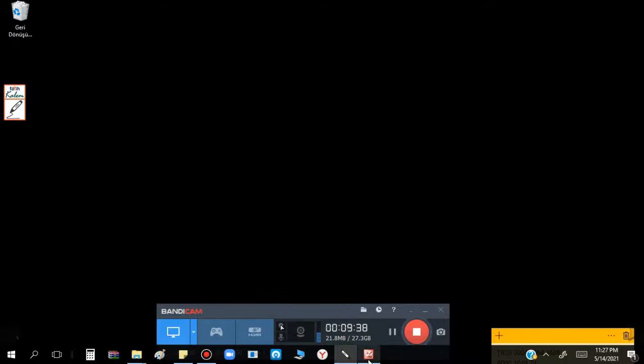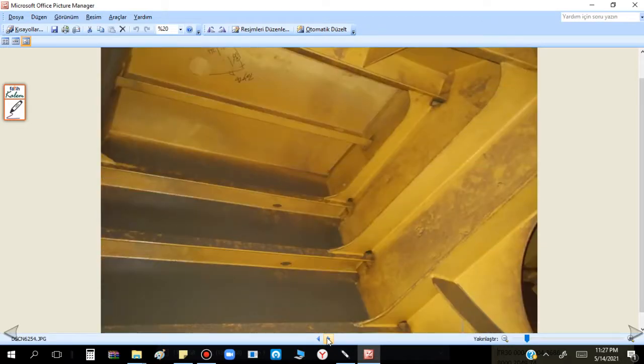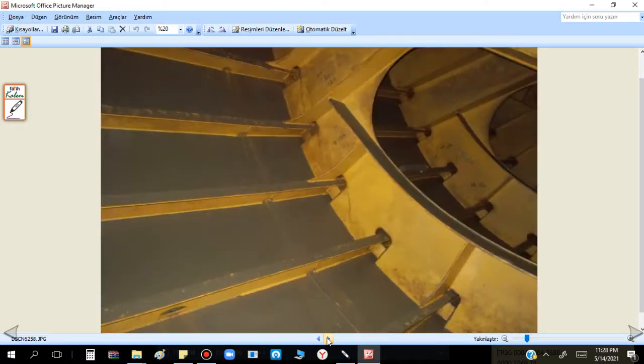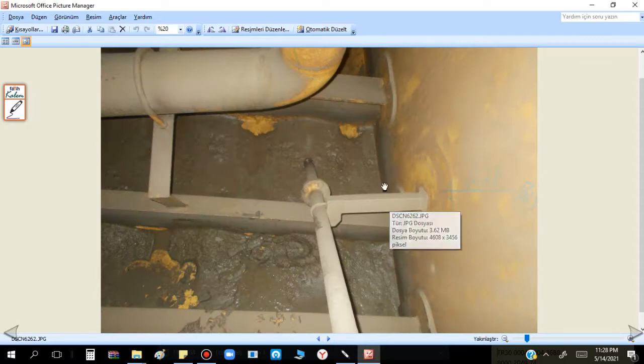Why first we take a photo? My friend, I will show in the photos — before you enter the cell, the floor is covered with mud. But if you step inside, the mud will mix with the water and the floor will not be clear — you will not see. So when you take photo first, it will be clear. That is why at first we take photo, check the floor by eye with the light, and then we enter to check other spaces. This tank is fair condition — painting is perfect. Cathodic protection is in good condition, no rust.